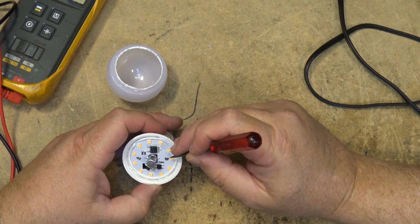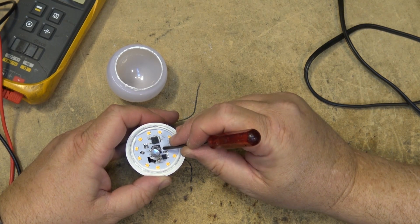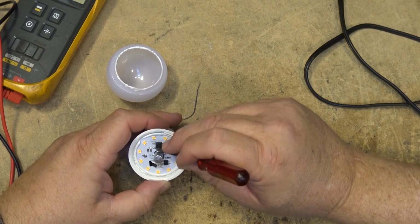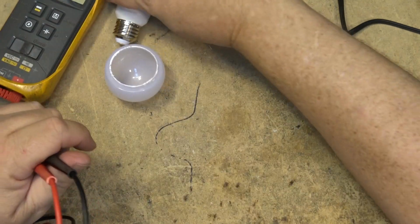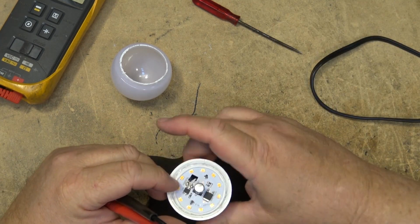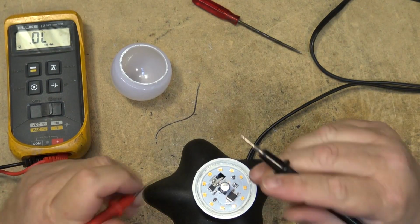And the negative side of the capacitor, where the heck does it go? It feeds in from the rectifier here. One side goes to the negative and the other side goes to the positive, and it looks like it probably works its way around to one of the terminals on here. Let's figure it out. Got a meter here. We can see where it goes. I'll put it in this thing. It's not plugged in, just to hold it in place.